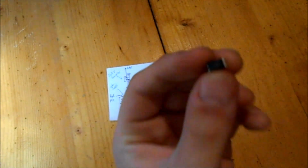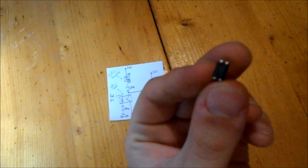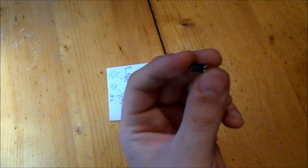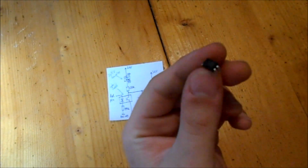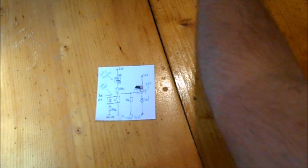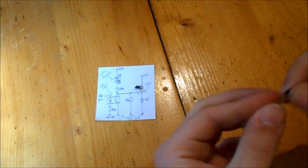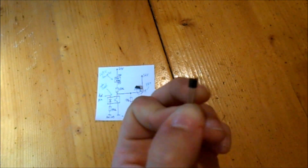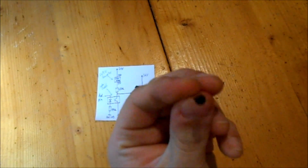What's an optocoupler? It's a little integrated circuit, maybe you can see it on the image. Of course, we need series resistors, otherwise the LEDs inside them will burn to ashes. Also, we need some FETs. Probably you won't even see them on the picture well, but otherwise it's a simple three leg transistor.